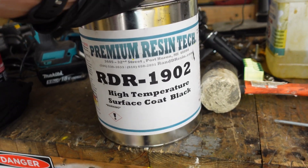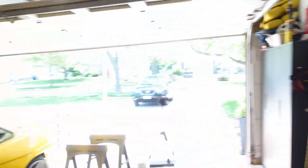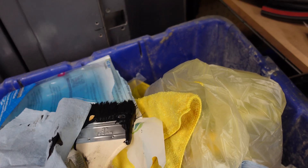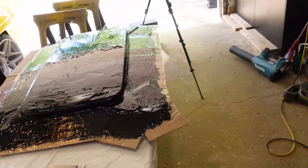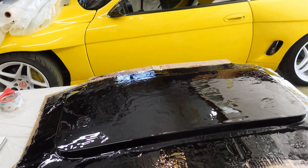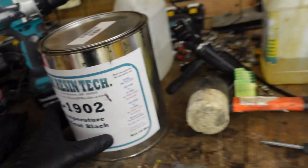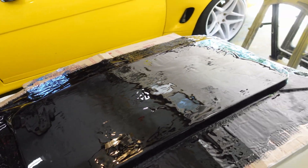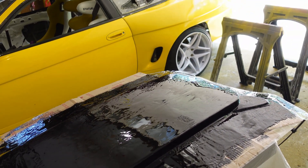Epoxy barely has any scent, that's why I'm using everything epoxy. As for this gel coat material, it's actually really really thick — basically like hot tar. I was using a wide brush, but for the underside I'm going to cut the bristles even shorter so they're stiffer because this stuff is hard to spread. This stuff now needs to cure — I need to check the data sheet for the cure time. It just needs to get tacky and then I can start laying up the fiberglass. While this is curing I'm going to cut all the pieces of fiberglass so I'm ready and don't have to rush.